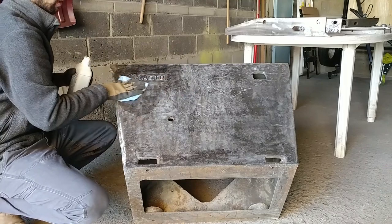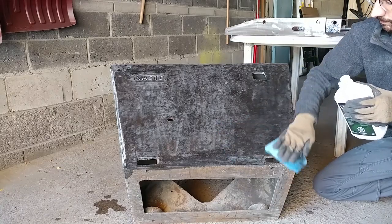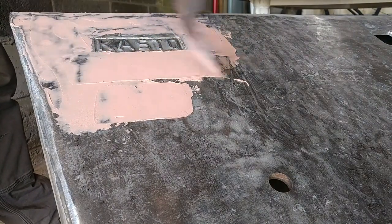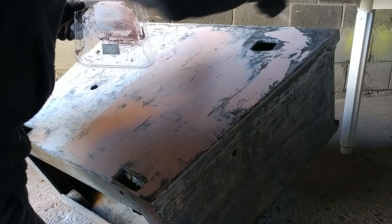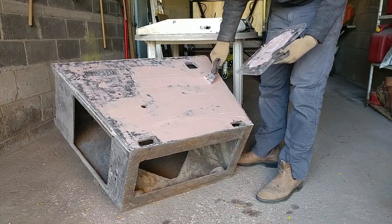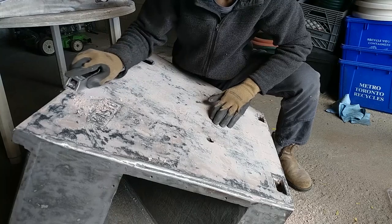The sandblasting exposed some pretty deep casting defects that would need to be filled before applying primer and paint. This is my first time using Bondo and the process went smoothly. The most important part is timing. When you let it set up for about 15 minutes, it sets up to the consistency of cheese. You can then take a rasp and grate off the high spots and you're left with only a little sanding to do. I wasn't striving for perfection as this is a machine, not a '56 Chevy, but I think the results are more than acceptable.